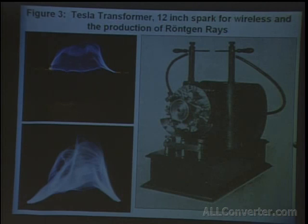For short periods of time, undamped oscillations were produced in screwing the vibrating spring tight against the iron core and then separating the contacts by adjusting the screw, which also performed the function of a key.